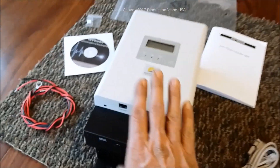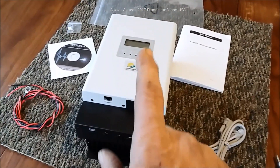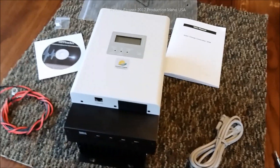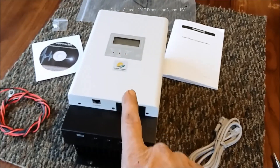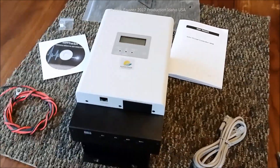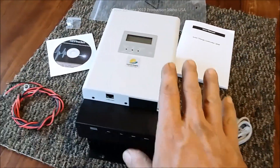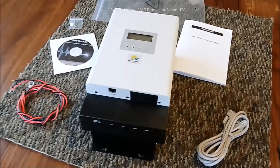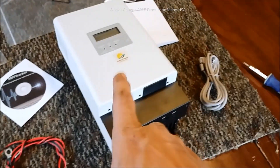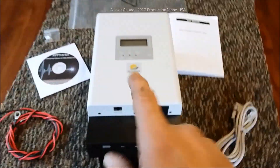This works well up to about a 1,500-watt truthfully-rated wind turbine. Missouri Wind and Sun turbines are not truthfully rated; Thermodyne is slightly boasted but mostly close; Hurricane Wind and Sunning/ULU are very accurately rated; ALECO is about 70% close. This unit is pointless on anything under 500 watts, but for MPPT on a wind turbine it's the jewel to use — better than an Outback, better than a Midnight Classic, and less than half the price.